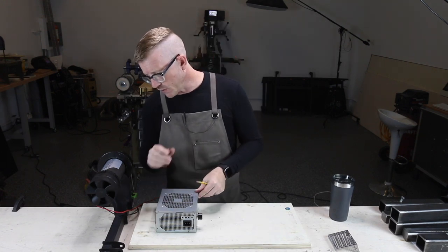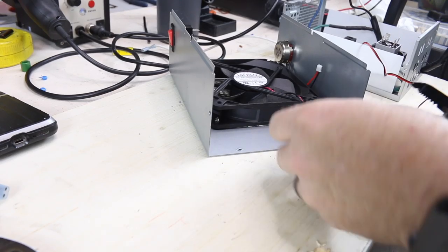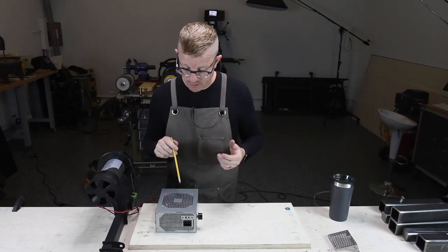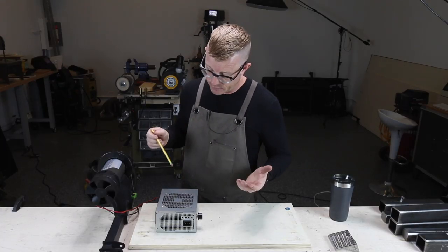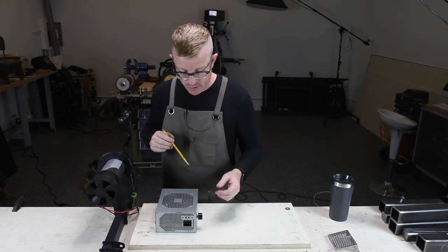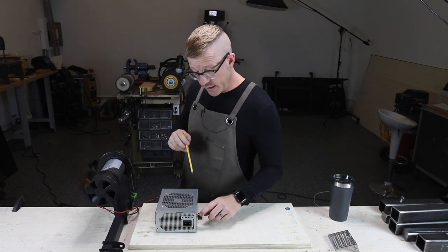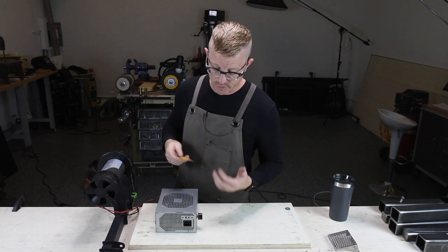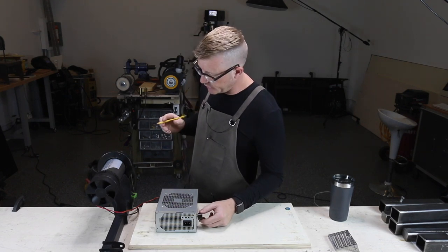All right, so we're going to click on the power. The fan that was in the power supply is actually a 12 volt DC fan, which the motor controller outputs 12 volt DC — so I just went ahead and used it for cooling, which is kind of important. The potentiometer on this particular one is 220K, which is about right for what we want to do, so I didn't even bother to swap it out. Let's turn the potentiometer up just slightly and see what we get.